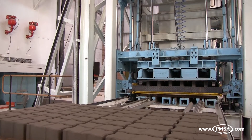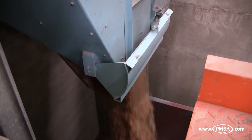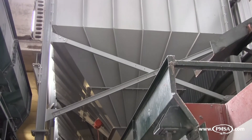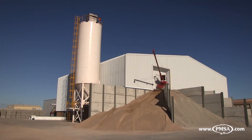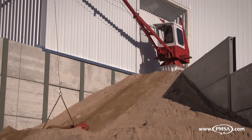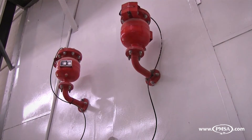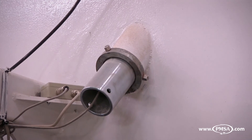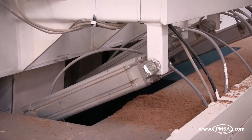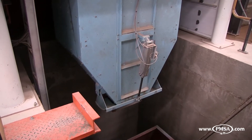To manufacture concrete products on a large industrial scale, materials first need to be weighed off before being loaded into the pan mixer. Two options are available: the aggregates bin and weigh belt system, or the bulkhead and boom scraper. The bulkhead is available with either three or four stock compartment bulkheads separating the different aggregates. The boom scraper keeps individual aggregate compartments full above the discharge gate. Air cannons ensure free movement of finer aggregates more prone to sticking, and any moisture in the aggregate is compensated for through a Ludwig Microwave Moisture Measurement Probe. The pneumatic discharge gate fills the aggregate scale, which accurately weighs off materials before discharge into the loader skip.